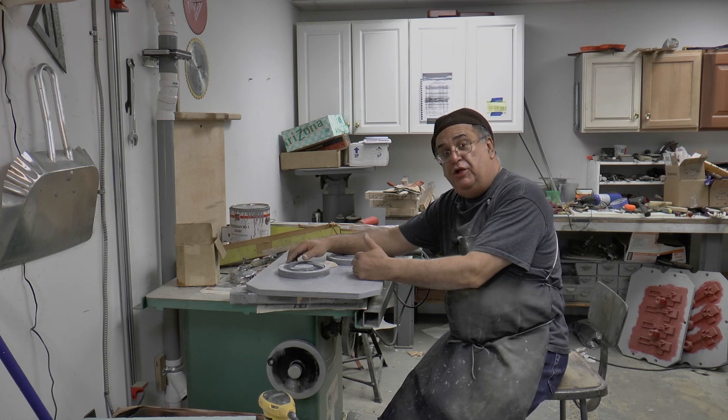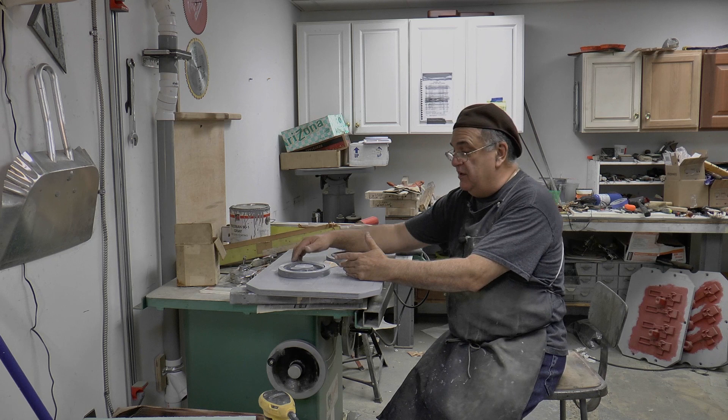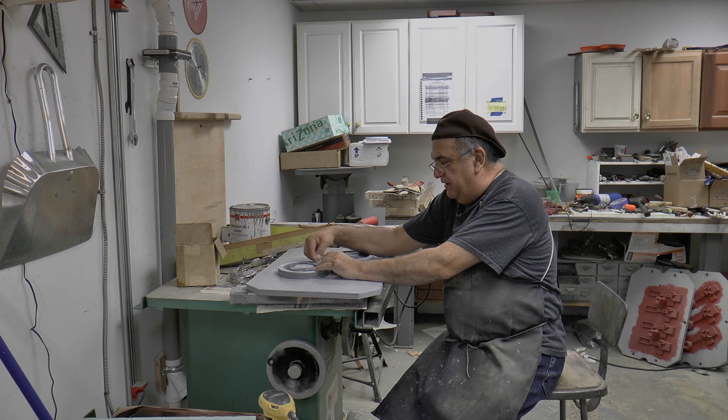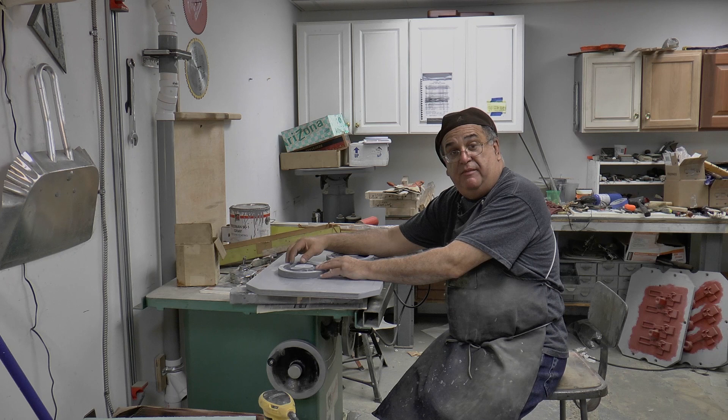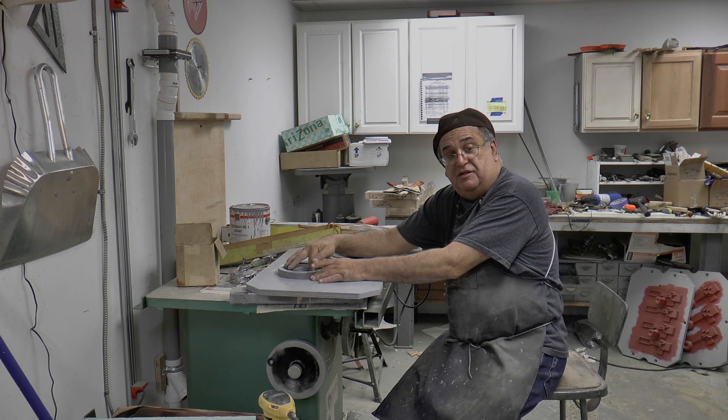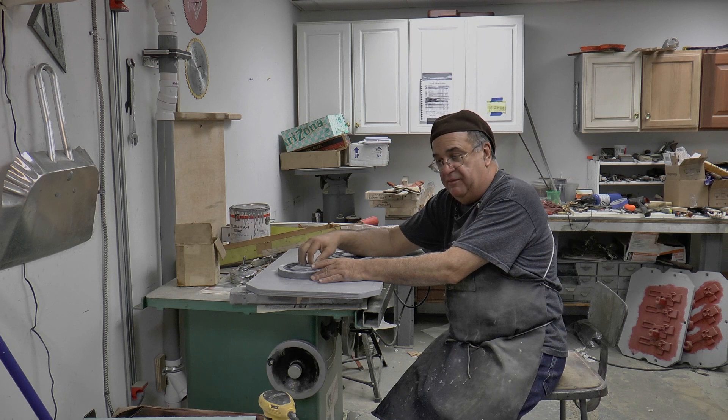Don't forget - what are we going to use to make the mold? Sand. And sand does what? It's abrasive. So when they put the sand in here, after a couple of molds, all this is going to get kind of sanded. And again, it breaks in and then it just comes out. Now this mold here popped right out of the repro mold, so that means it's going to be a good draft, good release piece. It's not going to grab on the spokes in here and make a mess, because if it makes a mess in the spokes, then you've got a filled-in spoke, and that looks like crap.